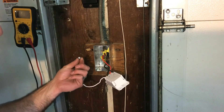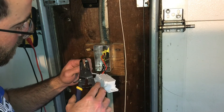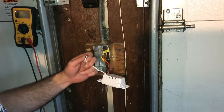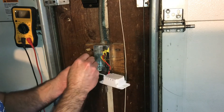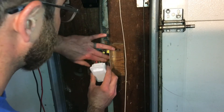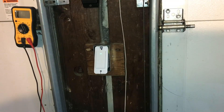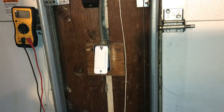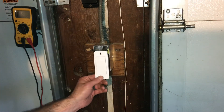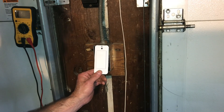To connect the neutral to ground, I'm going to get an additional unpainted screw, strip the wire a little bit longer, wrap it around the screw clockwise - because that's the direction you'll be tightening it and it won't unravel - and screw it right on top there. You can already see the difference: I have the indicator light blinking, waiting to connect. And the switch works. I'm going to turn the power back off, wrap this back up, and go through the setup.